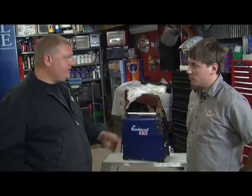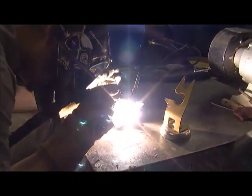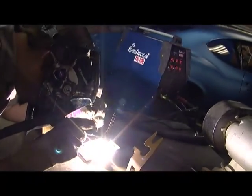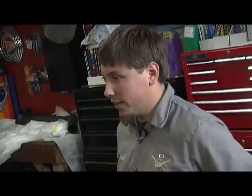A lot of people ask about welding aluminum, which is tricky to do at home without a TIG welder. The aluminum actually went pretty well — you just have to switch it to AC and use a different filler material, but it welds much the same, just takes a little more effort. Since you can't see a color change on aluminum, you have to listen more. It has a higher pitch, so once you get the sound of a good bead down, you can be pretty effective.